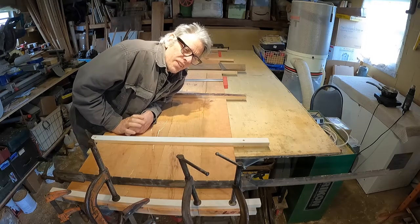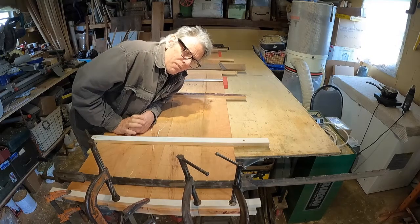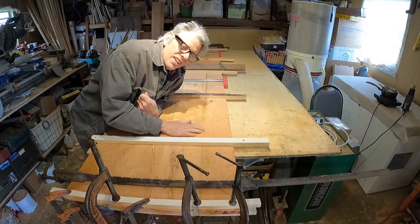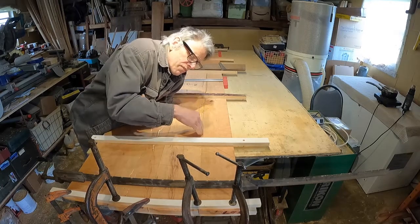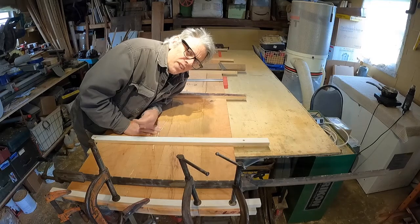It's cherry wood. It's all glued together. It's been sitting for a while. And we're going to unclamp it and spin it over and see if I messed up on the glue. This is the back side. And if you put too much glue, it seeps to the front side, and then that's a lot of sanding and you never really get it out. So hopefully, if I'm lucky, we'll unclamp this and it'll be good.